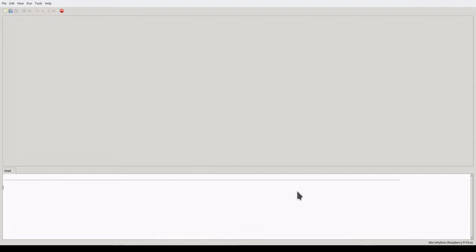This will take a few seconds. Then open up the Thonny IDE and see the board. You may need to go under Run, Select Interpreter to connect if it doesn't automatically. Under the shell window, we can see that it booted MicroPython 1.18-128.